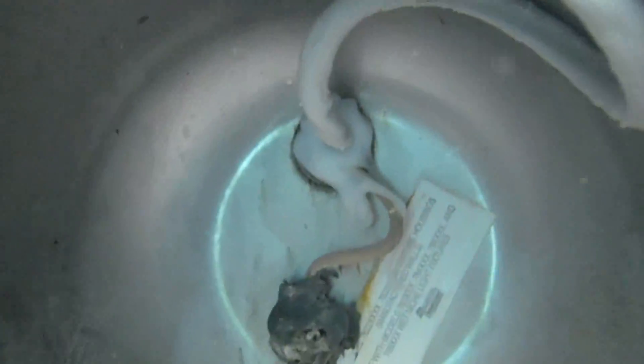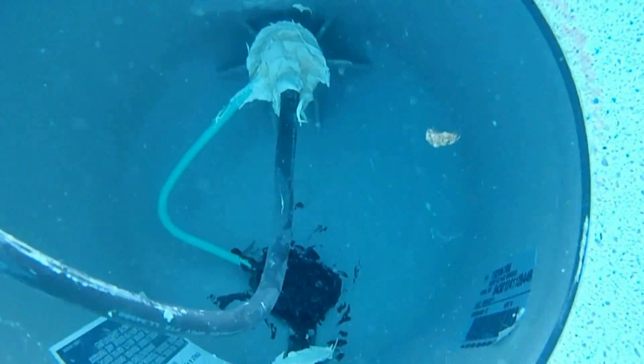When a new pool is being built, it's common for silicone glue to be shot up in the conduit. After a few years it can lose its adhesion and get loose and still just be tough to test. This white seal looks real good until you pull the cord to the side and then dye test it — this seal was the leak I was looking for. Whenever I see these silicone repairs, I have to pull out the old patch and reseal it with white quick-set epoxy.